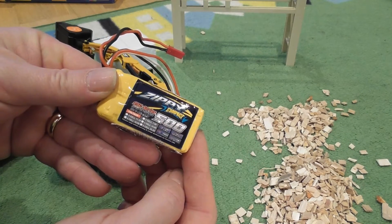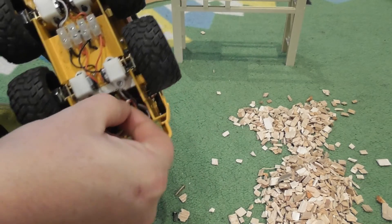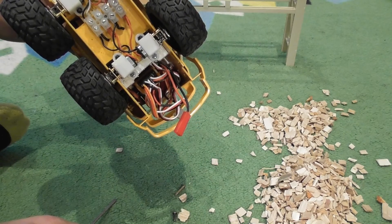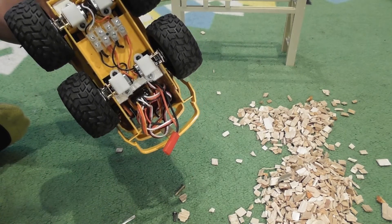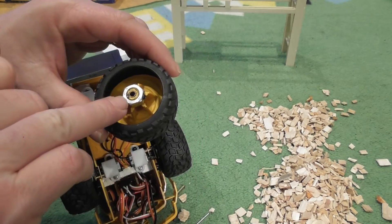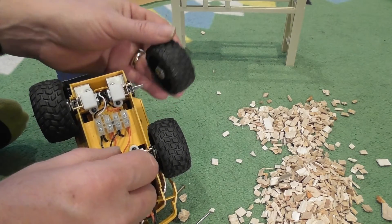That's the battery I'm using — it's an obsolete one but later batteries with higher capacity have been made; you just need to check it fits in the space. Underneath you can see an orange Spektrum-compatible receiver — just the smallest one I had. There are four N20 gearbox motors, the 100rpm ones. I tried the 200rpm and the thing flew around and wasn't really controllable enough. The wheels are my usual custom conversion with M8 bolts, a 4mm copper tube sleeve that goes straight onto the 3mm shafts of the N20 motors.